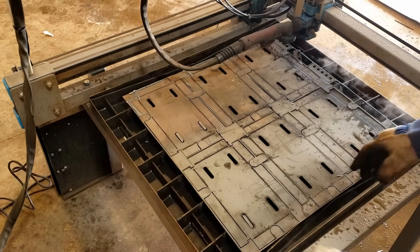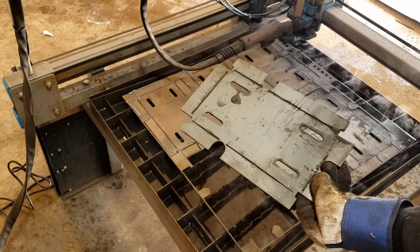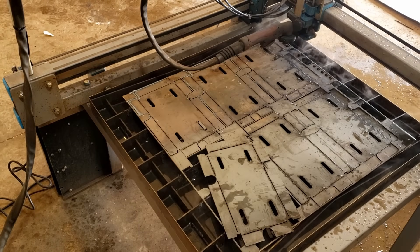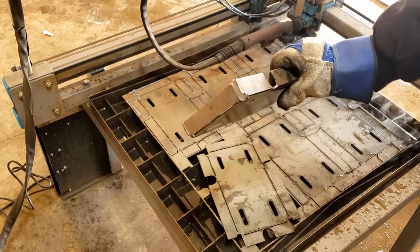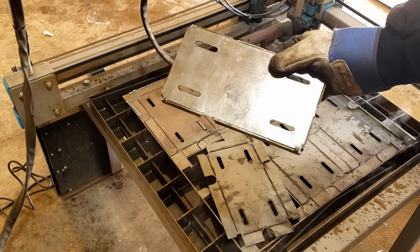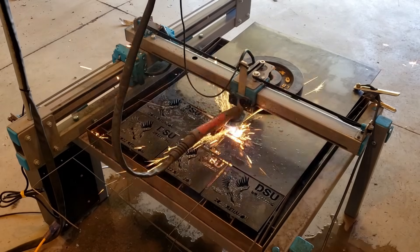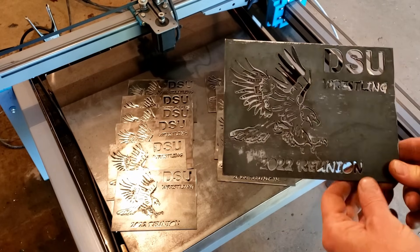This is one of the big reasons why we decided to build this machine — so we can make parts like this. We made this engine mount for the trike kits that we sell. We put bend lines in here to make this piece, and it turned out real nice — very little slag. With those bend lines we can bend it and then run beads in here to get a nice strong engine mount. It makes fab work so much simpler. We've also done some sign work — imported logos, cut them out, and did sign work for some people. This machine is completely versatile.